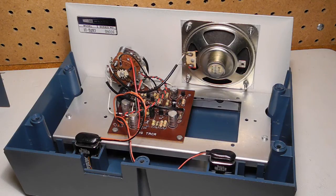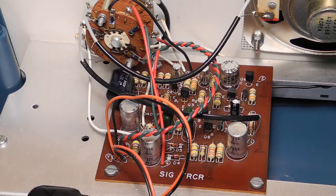The circuitry is contained on one printed circuit board with some point-to-point wiring to the function switch, input jacks, and speaker, some of which uses shielded cable. It uses a 3-inch 16-ohm permanent magnet speaker. The circuit uses eight transistors — one is a Darlington pair and one is a unijunction, which is used for the volts per ohm oscillator. The rest are bipolar transistors. It's interesting that the circuit uses a unijunction transistor in a relaxation oscillator circuit, as older tube-based signal tracers often used a relaxation oscillator circuit using a neon lamp.